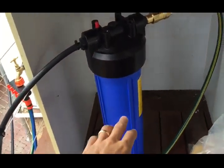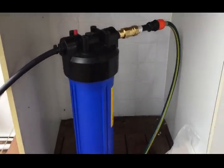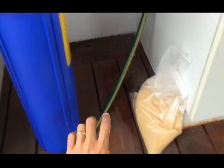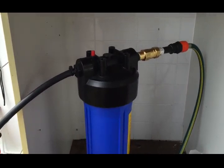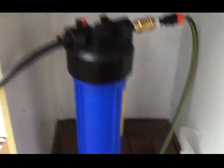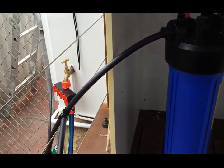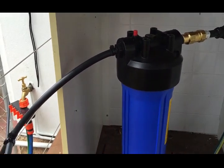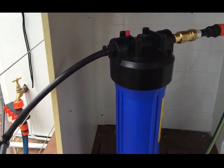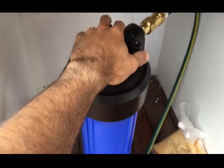The reason for hooking it up in reverse is what's inside it. Normally you'd have a polyethylene sediment filter or a carbon filter, but here we've filled an empty cartridge with a special water softening resin — Purolite 100C. It swaps its cations, exchanging calcium and magnesium in the water for sodium. I tried running the system on straight tap water and within a couple of days the panels were white with scale — calcium carbonate and magnesium carbonate that crystallise out and are hard to remove without acid.